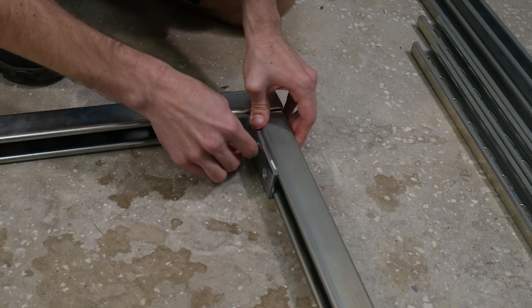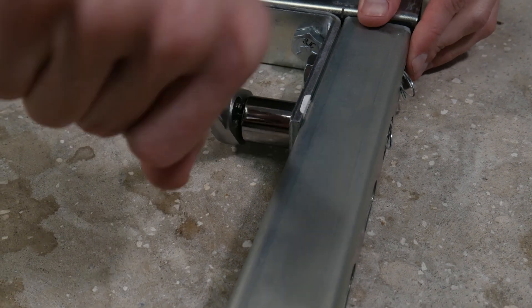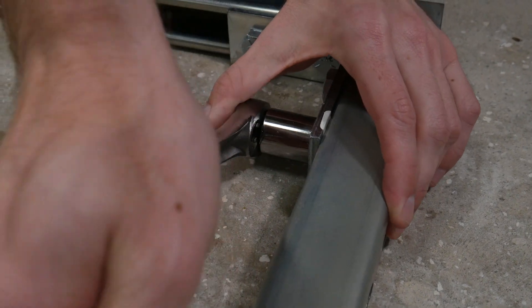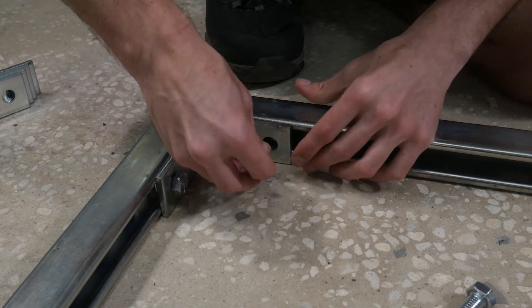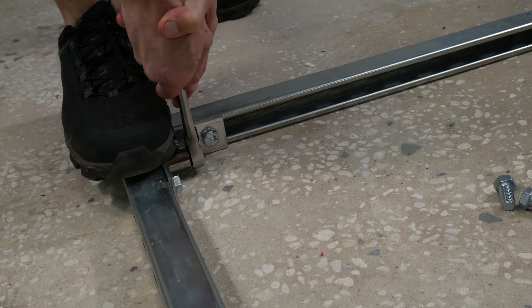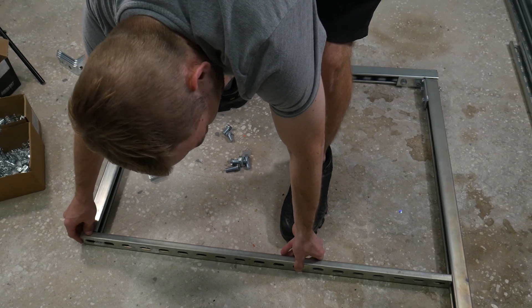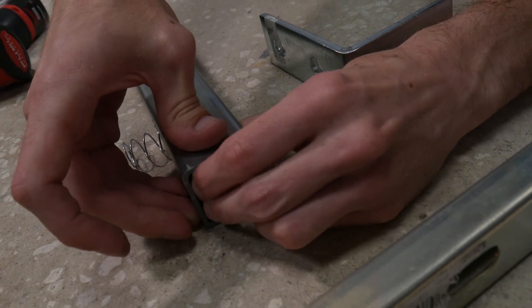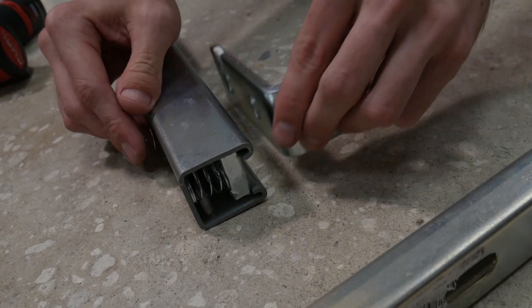So we started with the left structure of the table, and that required us to have the one extra long piece, which will hold the top shelf, and then the front shorter one, which is used to actually fix the height of the table. So that was the important measurement. All of these L brackets were pretty much the same to attach - we would just put in the spring fastener, add in the half inch hex bolt, and then tighten them up.